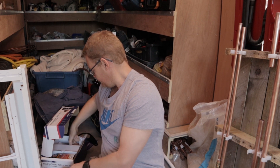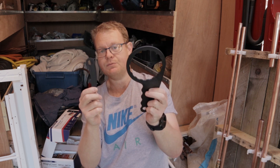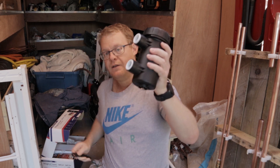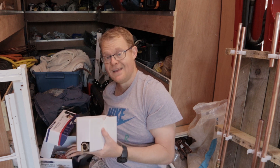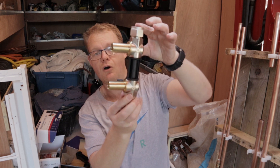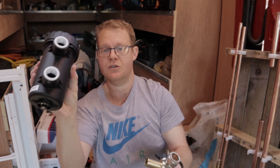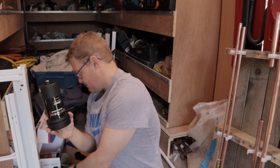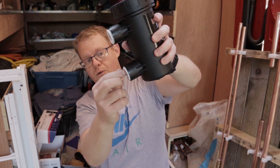So what else do you get in the box? You get the main canister and two spanners. Remember to put them somewhere accessible for when you do need to service the filter. One spanner is for the main lid on top to undo the canister, and it also undoes the drain plug at the bottom. Inside the box is also the main manifold for the filter. These two brass stems are where the filter will push on to once it's fitted. This is all push-fit fittings - it's got the normal collars, like a John Guest fitting - that's what we use to disengage the filter from the manifold.